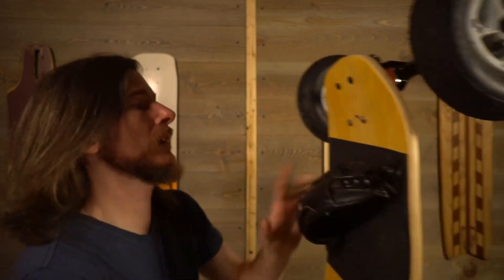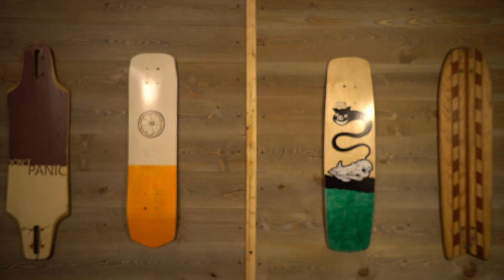All good mountain board decks do this, and I am stoked to see that mine is doing it too. If the materials hold up, if the deck doesn't get floppy and it keeps absorbing impact session after session, I think I will have a really good deck on my hands. And that's not to say I'm done — I still got a lot of work to do. I'd really like to get the wedge system to use stock hardware, and I'm going to have to remake the molds. I may want to adjust the footbeds, and my built-in drilling guides for the bindings and truck mounting holes didn't really come out right. Having those integrated into the mold in a way that works will make them much easier to produce when I get my production setup ready to go.